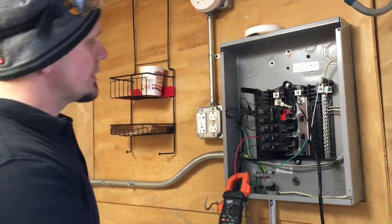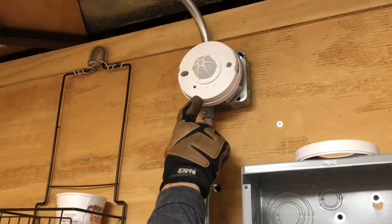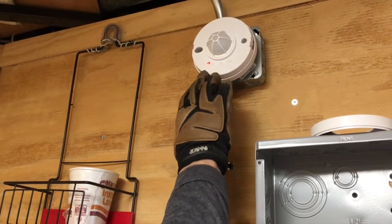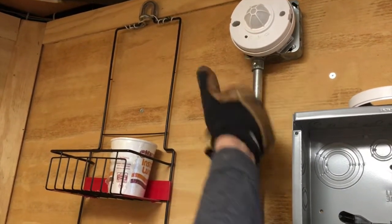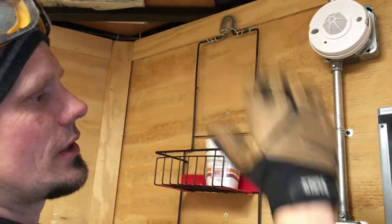This right here is a GFCI, so if I trip this it'll actually kill my sensors. These sensors have a photo-eye for sunlight versus nighttime, and I did have to adjust that to get them to kick on. Sensitivity I set really high because of walking in on the other side of the door, and the time I came down real low because I wanted them to stay on as long as possible. Anyway, I want to show you Gerald here.